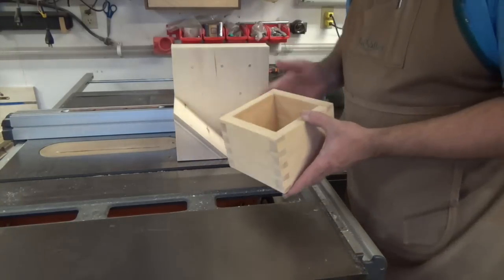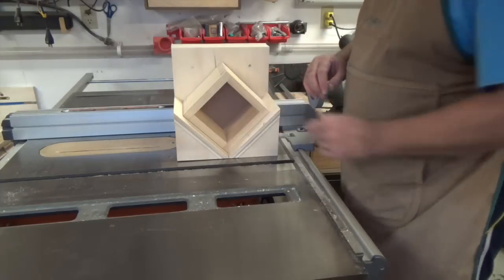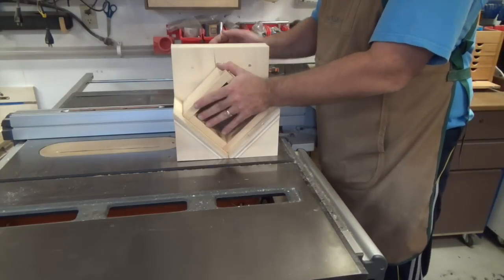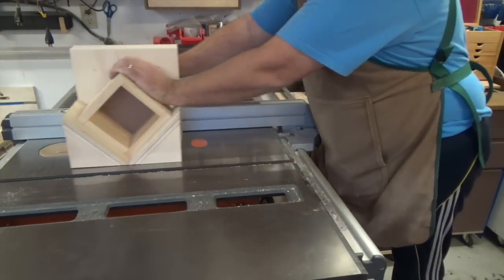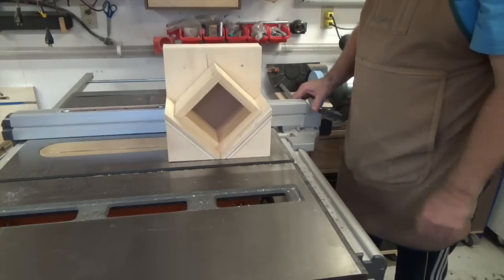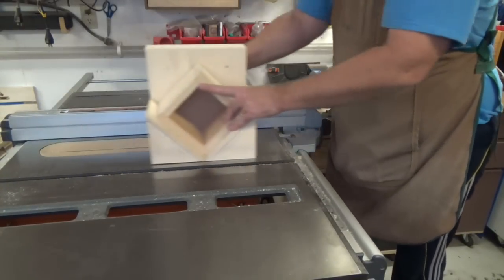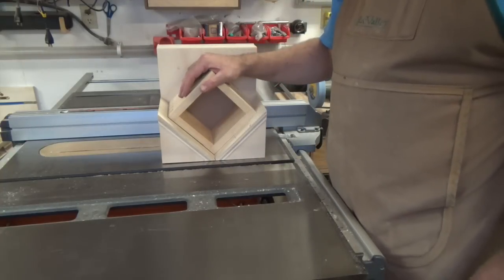Now this is one jig working all in one piece. I don't have a miter box I've made recently, but I've got this old dovetail one - I'll just show you how sitting this box in here, you can already see that the box is fully supported. I've got about an inch and a half of space still, but it's very easy to support your box with a clamp against this back support board, or just some downward pressure, and run it through your table saw blade to cut your splines. It's just a matter of adjusting your fence for the distance of wherever you want your splines, locking it down, and running it through. Once done, rotate your box, run it through again. I'd suggest clamping these boxes down.